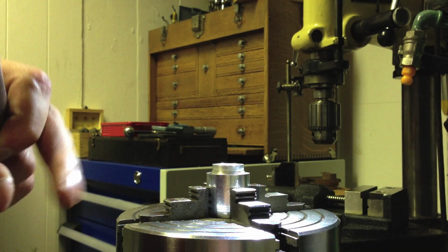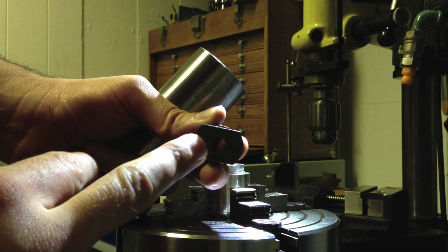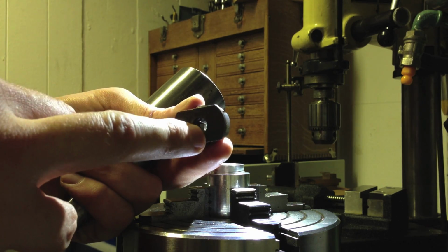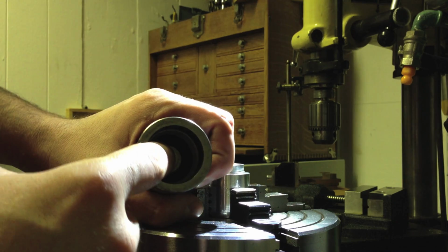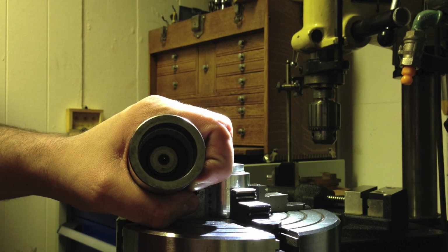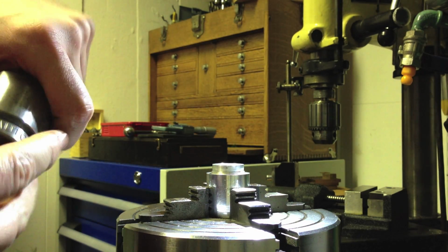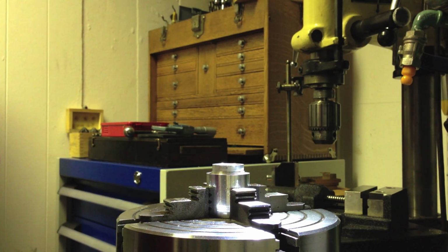But the milling cutters are threaded, and these collets are threaded as well. There's a bore down there that's threaded. As the milling cutters thread into that, the milling cutter takes into that little pip down the middle of the bottom of the shell. And so the two threads working against each other stop the milling cutter riding out of the collet holder. So it's a very, very secure way of holding milling cutters.